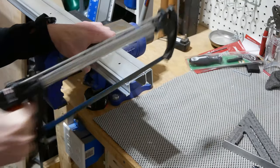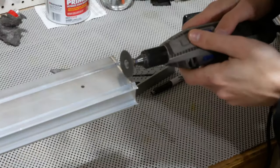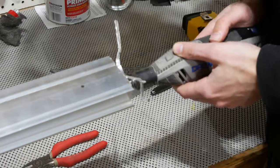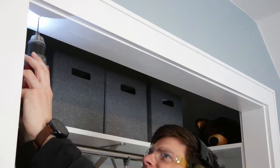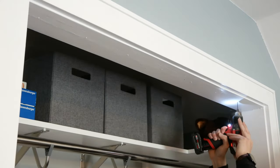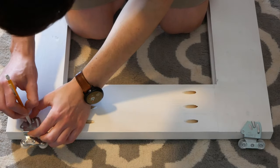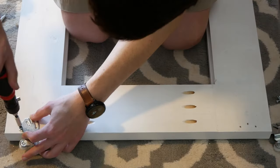The bypass door track I had was a little too long so I cut it down first using a hacksaw. That was too much work so I finished it with my Dremel — it probably would have been easiest to use a metal cutting blade on my jigsaw, I just didn't think of that till after. I put the track up into place and marked the holes, pre-drilled them, and mounted the track in place using long cabinet screws, as the screws that came with the track weren't long enough to reach to the header stud above the door frame. Next I mounted the door hangers, marking the top of each slot, drilling out each hole, and screwing them into place.